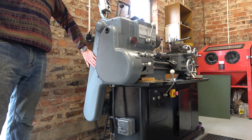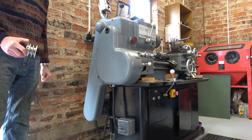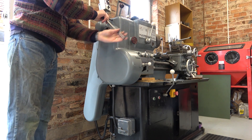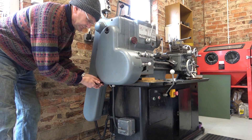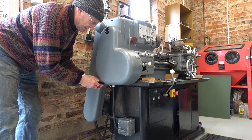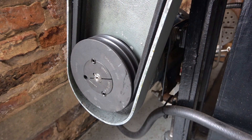So I'm going to take this cover off. I can do that with just three screws here and have a look at the pulley and make some decisions about it. Now that I get the cover off and I look at it, I realise perhaps my mind's been playing tricks on me a little bit, because I can see the belts are quite well into the V and maybe that's OK. But the belts are quite close to the case, and they do slap a bit when the belts are cold. I'll think about that.